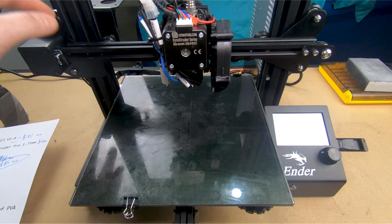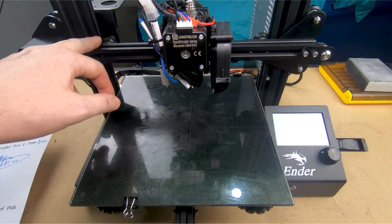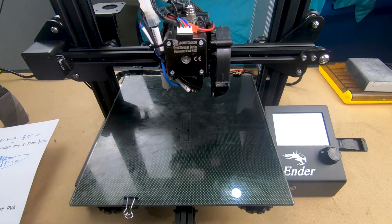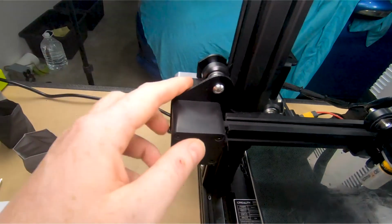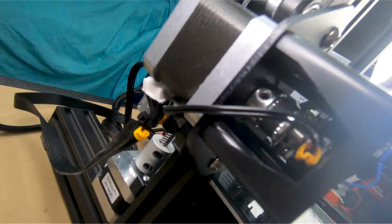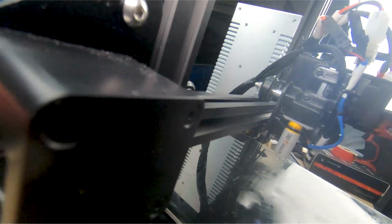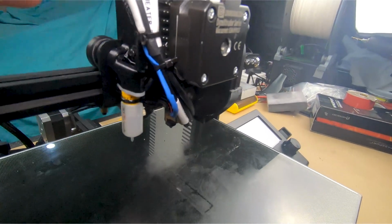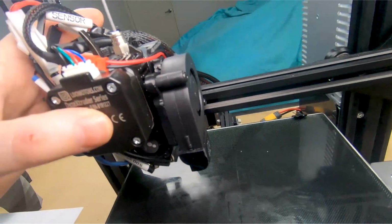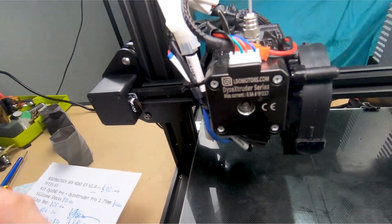There's no worries there. So what we also did with this is take the original extruder motor and swap it out with this motor, because this extruder motor is actually bigger. We'll move the camera here and we can see now. So we've taken this motor here, and standardly they have a press gear in them, but we had a gear that we could manage to bolt onto there. This has more torque, being an extruder motor, so it's a bit more safeguard knowing that this hot end is going to have a little bit more weight to it, because it's a complete direct drive unit. So far we've had no problems. We've been running this at about 150 millimeters a second just to really test, and we haven't had it skip any steps yet. Paired up with that SKR board, we're not really going to have any issues.